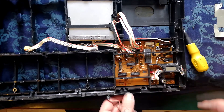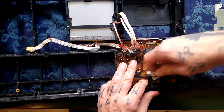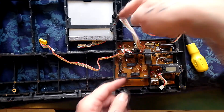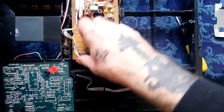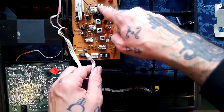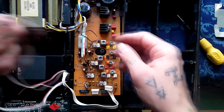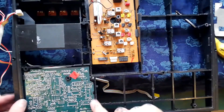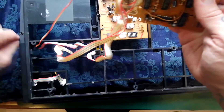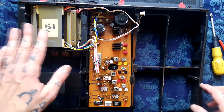Here's your digital meter - it looks fairly firmly attached to the plastic chassis. There is a white header for it here, and that's just to allow us to detach this system control board completely. Guessing that these other cables are going to go through this hole - we find they join onto this board back here. We've got one white one at the bottom sending signals from system control to these relays that control whether this is in record or playback mode. Then further up, one more black one, one more red one - two-pin and three-pin headers respectively. At that point the system control board should come away - there's just one clip here with lips on the other side.